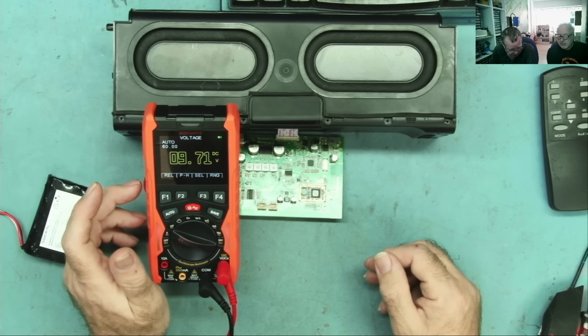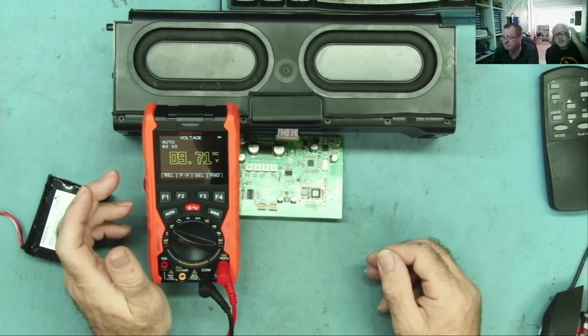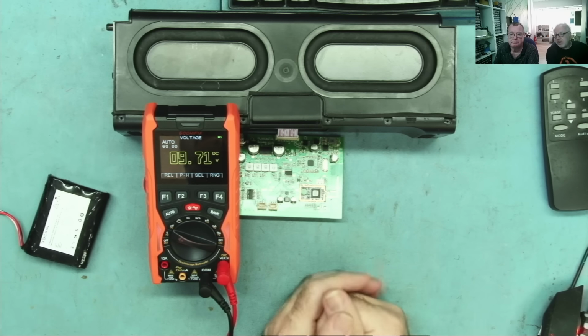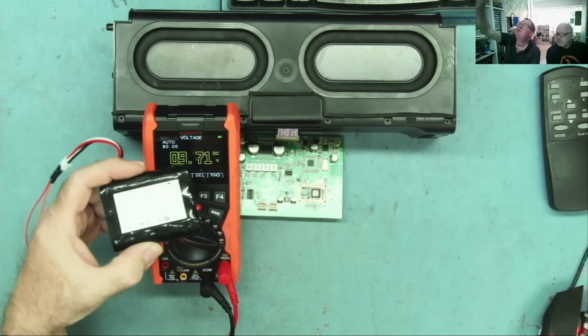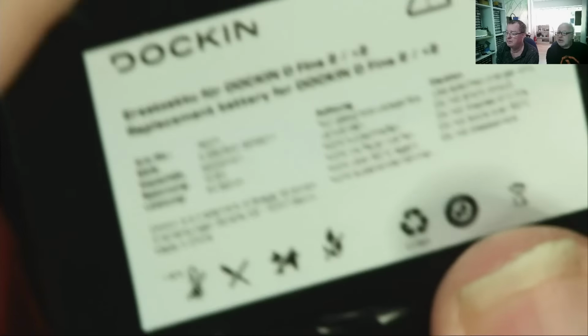We're going to charge the battery, you say? Yeah, I'd say we try if it takes charge. If you don't know how to do this, you simply grab your bench power supply. You go for the max voltage you can set. So in our case, it would be 12.6 volt for this cell. Three times 4.2. Are there some specifications on the battery? Yeah, probably.